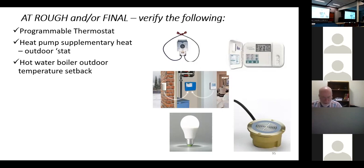I just had a conversation the other day. I'm doing an addition on my home. My existing house is evap cooled with just a basic evap cooler, and we're going to put a mini split in the new part. Is that okay? No, it's not okay, because you're adding a bunch of humidity that you're really not controlling, and then your refrigerant system is going to be trying to pull it all out. So that doesn't work. These big systems are usually about cooling and have the controls that maintain the humidity in a proper range. Very good, thank you.